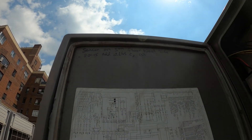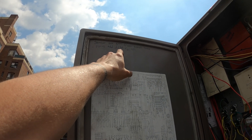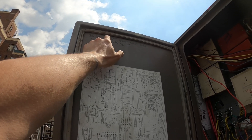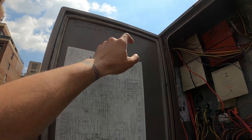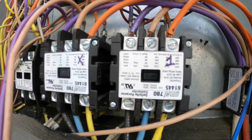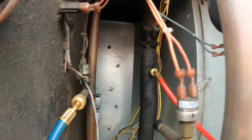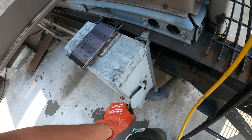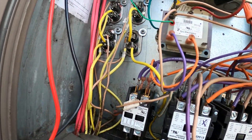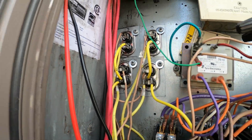If you look here, it says the sensors on the fifth floor on the west side. On August 31st, 2015, they added two pounds of refrigerant to circuit two, which is going to be for this one marked with an X. It's not even pulling in - that's got to be because it must be shut down on one of these pressure controls. First things first, let's turn this unit off. In the previous service call, I found a broken wire on one of the condenser fan motors and I replaced all the capacitors - they all had low readings.